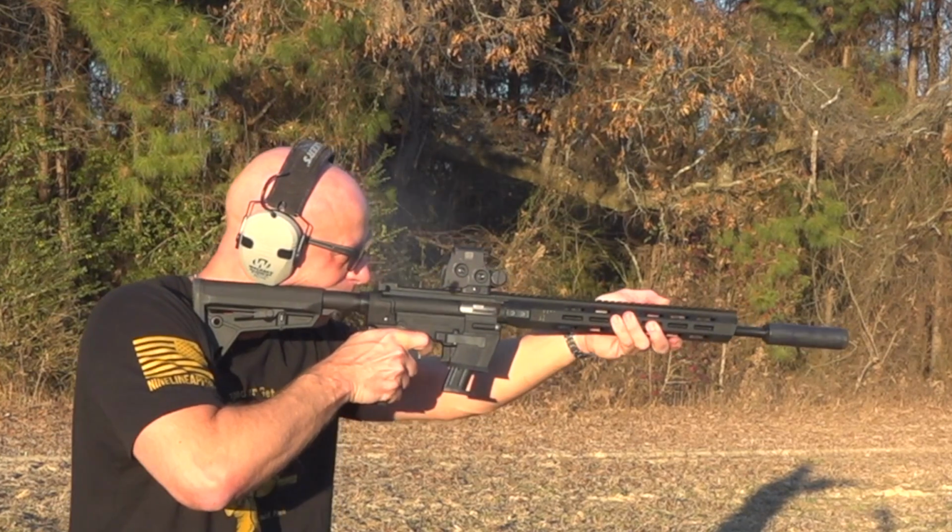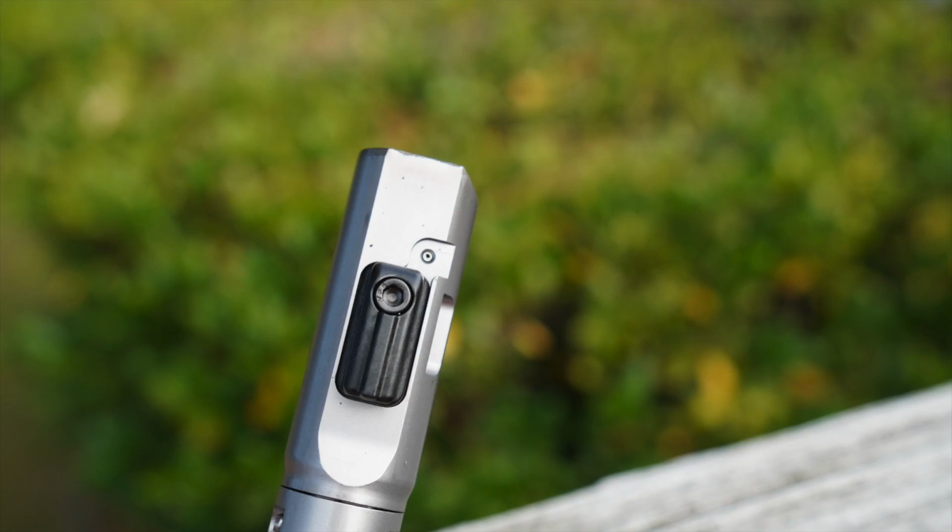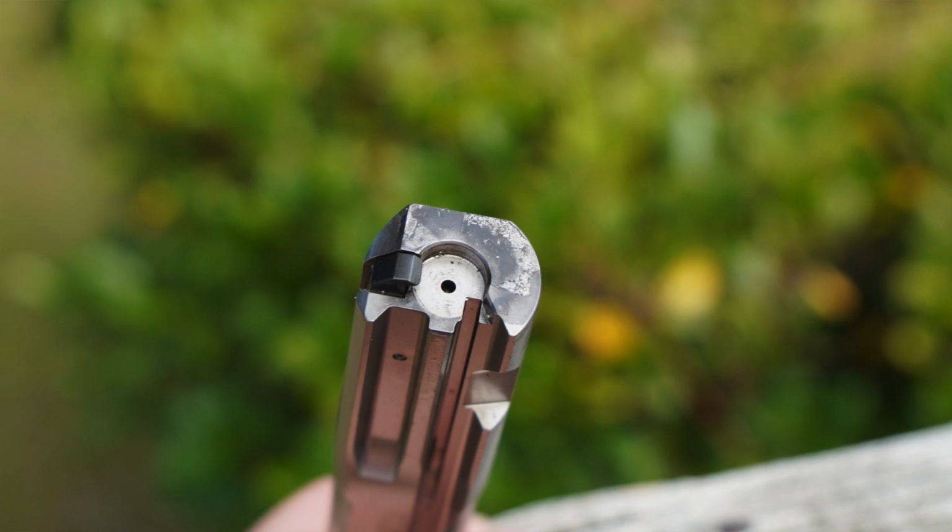Additionally, you can look up here, we do have this piece that is bolted on, and what that's for, of course, for the new folks, is just to make the charging handle be able to rack the gun. So it is fit specifically for that part, which is why, again, I do not think the charging handle is interchangeable. Bolt head up front is pretty much exactly what you'd expect from a blowback gun. We do have a beefy extractor, a pin that keeps it in place. If you ever did want to work on it, clean it out, things like that, you can drive the pin out for maintenance. And then, like I said, it is two pieces.